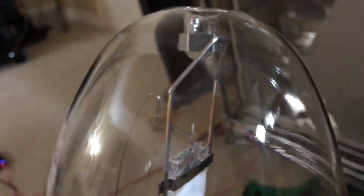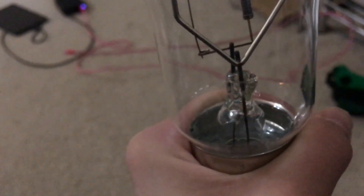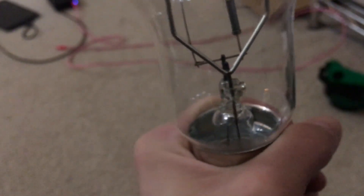You can see this other wire going to the top electrode of the arc tube. Of course, we have the dimple as well. Here's the little tip on the arc tube right here. That's pretty much it with the construction. I'm going to give you some specifications about this 5000K metal halide bulb and then I'll be turning it on. This particular bulb produces 32,500 lumens, which is still very bright — nearly equivalent to my Sylvania 400W ProStart metal halide bulb.